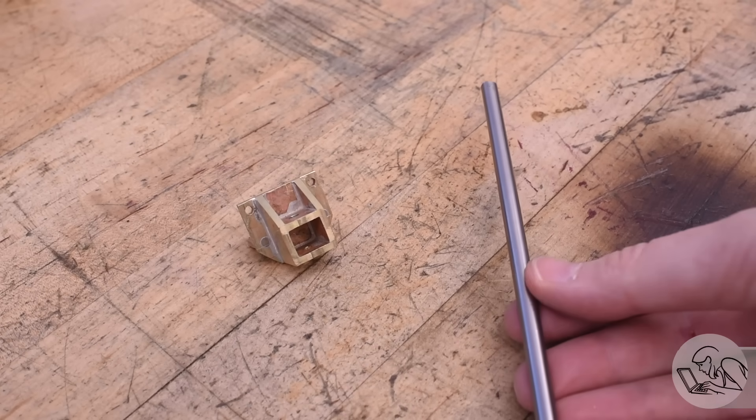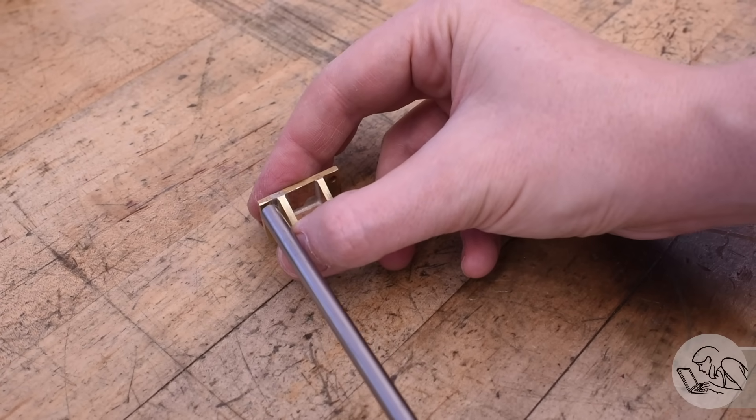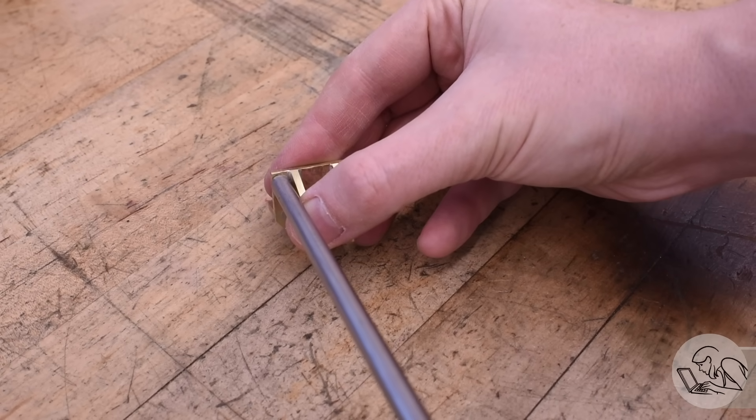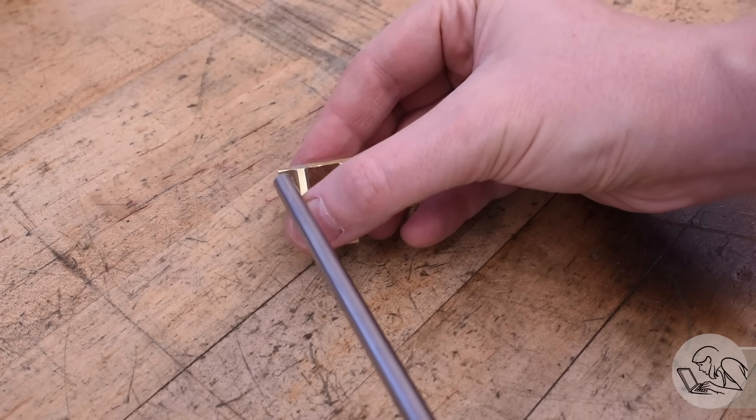To make the buttons we have to use tool steel because they are going to be hardened. I've got some O1 tool steel here in the form of drill rod. The radius of the material needs to be the radius of the curve that you're trying to create. I happen to have drill rod the exact right size, but if you don't, you can simply turn it to diameter.